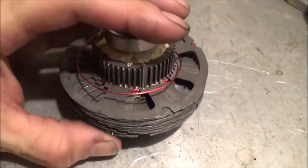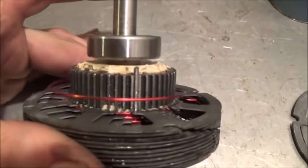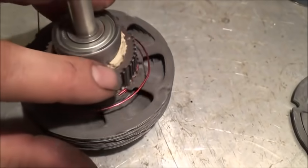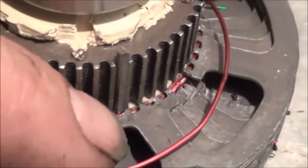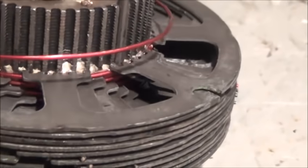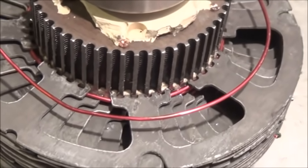So I'm about halfway done with our Tesla turbine here. I want to show you how I'm keeping these so they'll never rotate around the center of that shaft. Right here, you notice that little tall pin sticking out at the tip of my finger — there's another one right over here. These are keeper pins, and they're just big enough — I had to shave them down with a grinder — just big enough to slide down inside of these channels and still line up with these teeth on the other side, the outer stator ring teeth there. I push them down and glue them into place. Every time I stack a new ring, I offset by one tooth. You should be able to look through and see an air gap going all the way through — the spiraling staircase look right here. So I'm staggering each one of these blades, making sure that this turbine has really a turbine-style blade system in it — it's not only a Tesla turbine, but it also has a normal-style turbine in it.